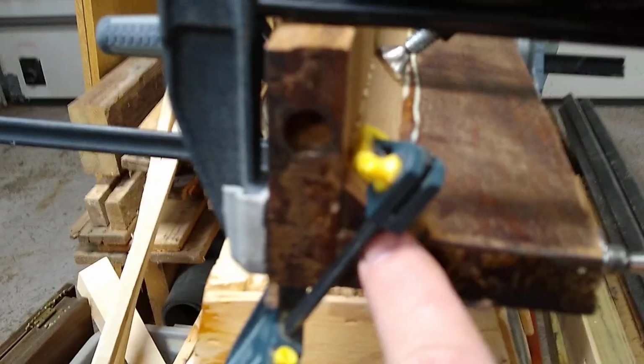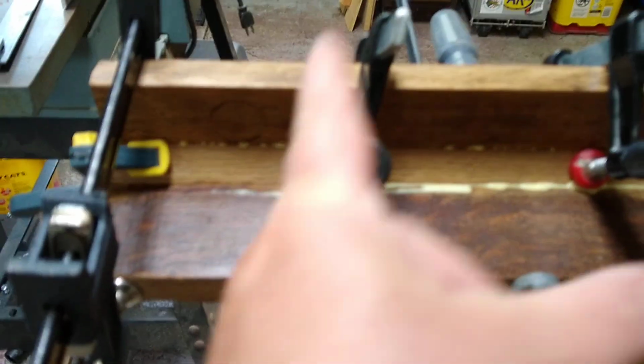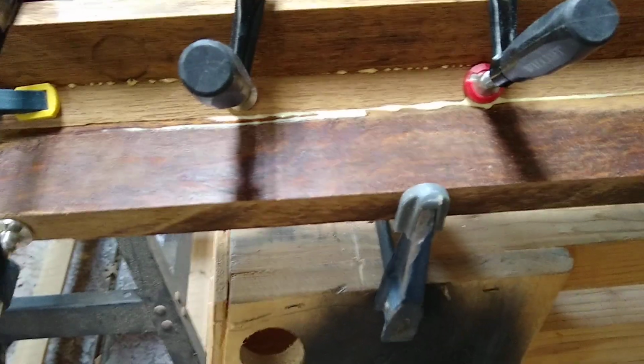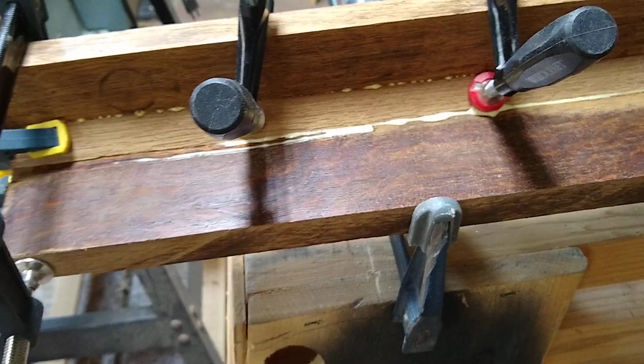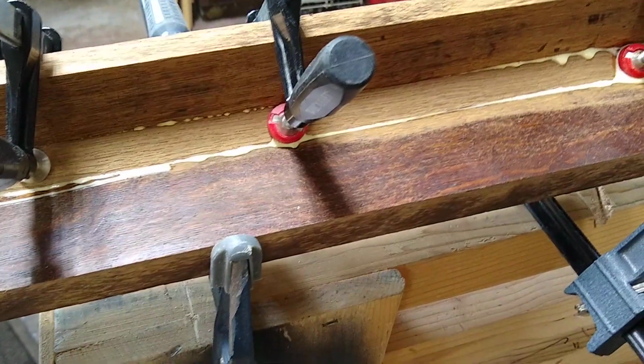And it's just a very simple joint here with a 45-degree reinforcement. Sorry for the camera work. It's a phone and it has issues like the guy running it. So that's glued up, and then we're just going to put this on the bandsaw, and we're going to make nice little slices on it to get that L-shaped bracket with a little bit of reinforcement, a decent amount of meat on the back side of it so that we can have the sufficient clamping force that we need, and then we'll shape it on the sander and make it round and pretty-ish as much as we want to for it being a tool.